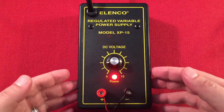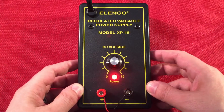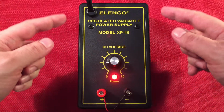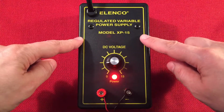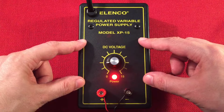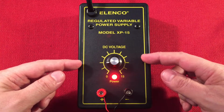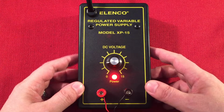A really simple design. In the manual, they actually go over in the end a little quiz on what's going on with the whole circuit: how the transformer works, bringing the 120 to 18 volts, and 18 volts going into the board, and how the board fully rectifies that signal to DC, and how it reduces and smooths out the DC current to give you a nice variable output. And it's regulated by that 317 IC.